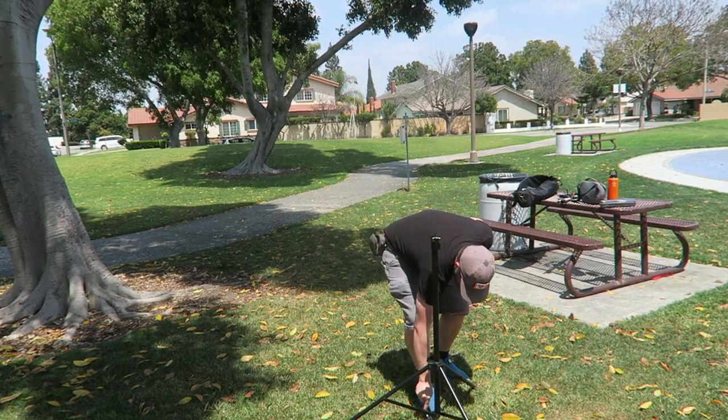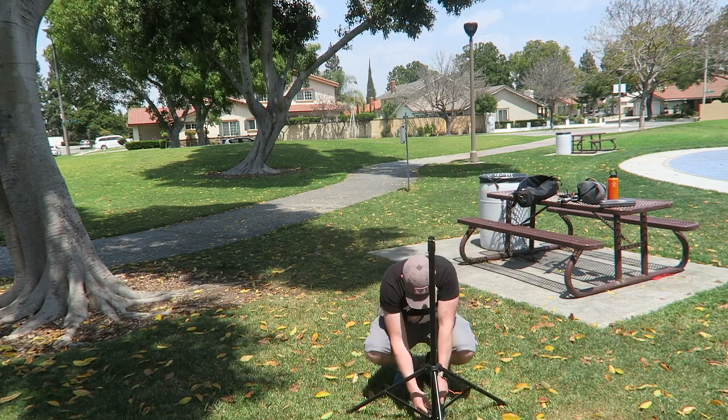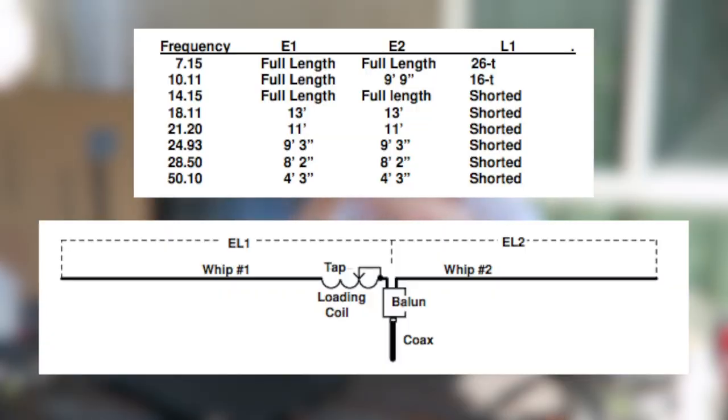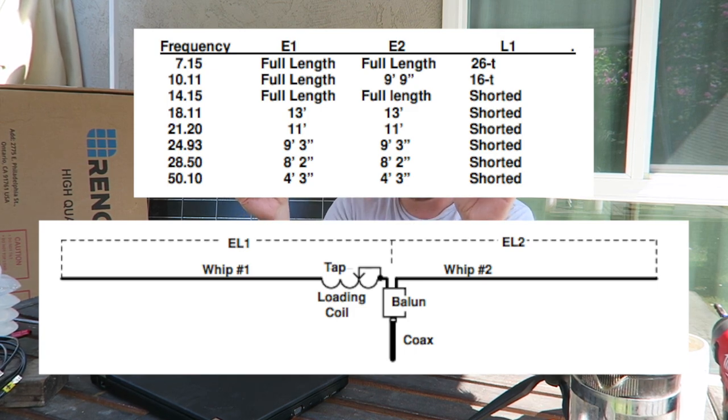Here are a couple of pointers. First, you need to stake it to the ground. What I do is run a stake right below the middle of the tripod and then use flexi tie wraps to tie the stake up around the bottom of the tripod. That'll cover you for a light wind. For stronger wind you'll need to guy line it down. I also printed the instruction table — the one with frequencies in megahertz, rod lengths, and trap positions — laminated it, and keep it with the antenna bag. It makes it really easy to get on whatever frequency you're targeting. I do use an antenna tuner.